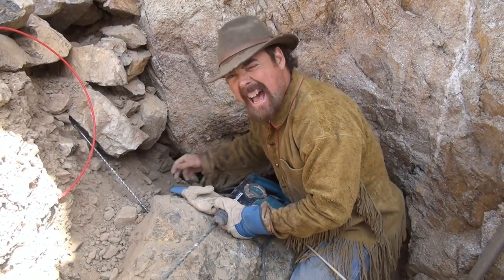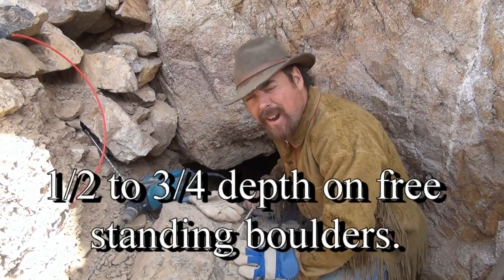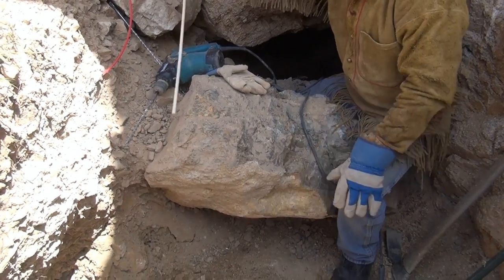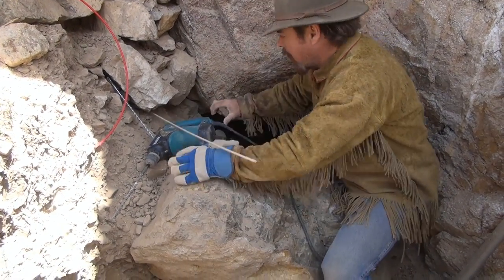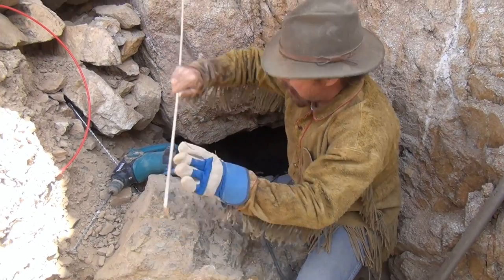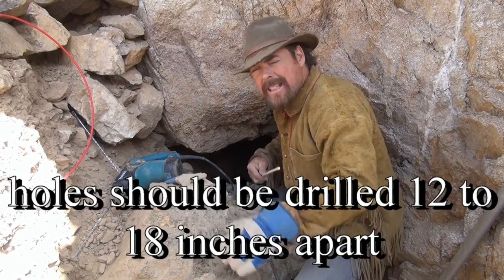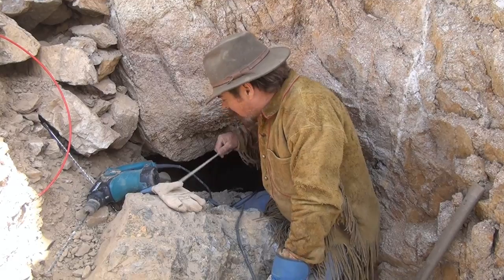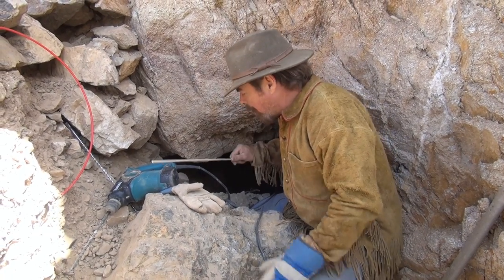Before you get excited and start drilling, remember: you don't want to go all the way through the rock. You want to be at least halfway through, if not three-quarters. My rock is about 18 inches thick. I highly recommend you get a measuring stick and put it in the hole to find out how deep you are. Right now I'm about three-quarters deep, so I'm not going to go any deeper. I've got one next to it that's three-quarters too, so I'm going to blast these in succession and fracture off a big chunk of limestone. Since I'm starting to work under an overhang, I've got to put my hard hat on.